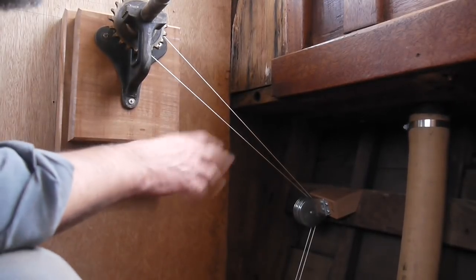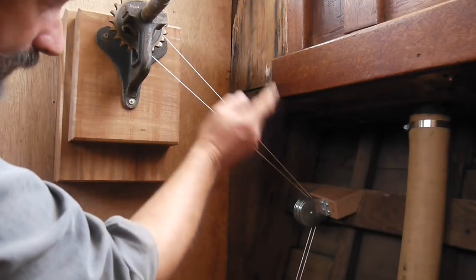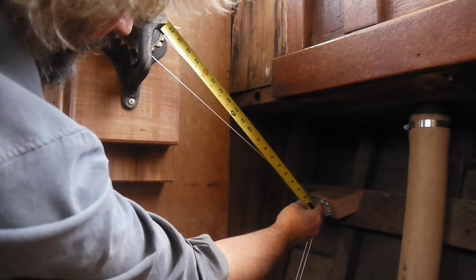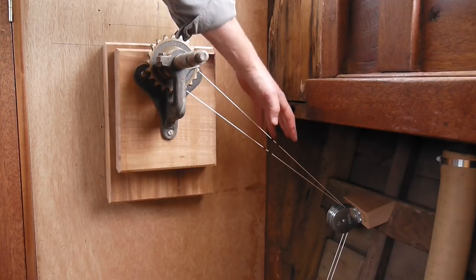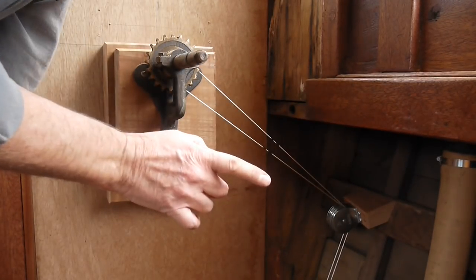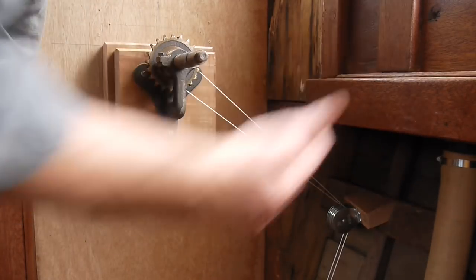Now the beginning of the calculation for how long to make the cables. All I've got to do is put a piece of tape on this piece of string - seems too easy, but it's the case. I just measure halfway between the center lines of both of these and it's 22 inches, so I add 11 inches and cut it right there. I've marked here and underneath the bed, offset by 24 inches, and I've marked at the quadrant. So now I'm going to cut the string at the quadrant and pull it all back through.